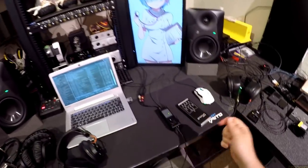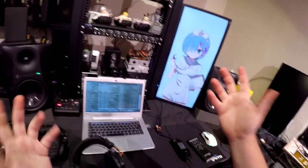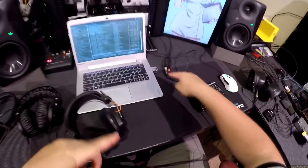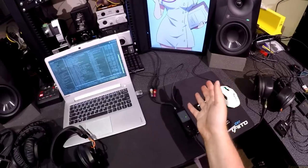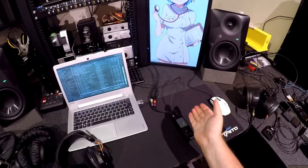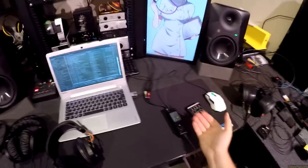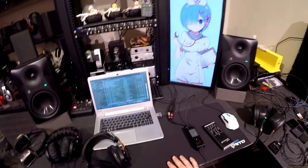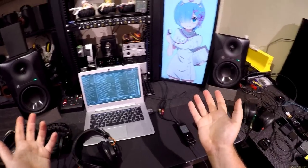See, here's the thing. Usually people come to me and they say, "Hey, look, I have these headphones, and do I need a new one? I want to get this DAC amp instead of this DAC amp." And the problem is the two DAC amps they're talking about are USB powered. Like, this is USB powered. It's getting all its power from my laptop through USB, and it's making 5 volt at the lowest amperage it can imagine, because it can't assume you're giving it like 3 amps. It's got to assume it's got to work at 1 amp. So a 5 volt, 1 amp maximum, maybe even half an amp, is what every USB DAC needs to be able to run on. So when you say, "I want to upgrade, I need more power," and you keep shuffling around USB DACs that are USB powered, there's no benefit there.